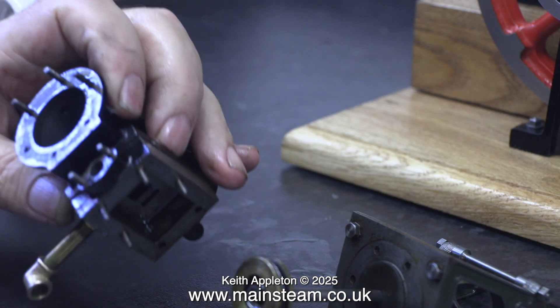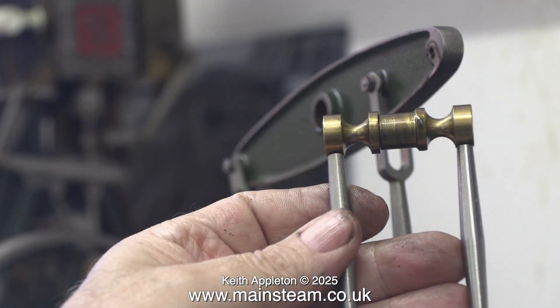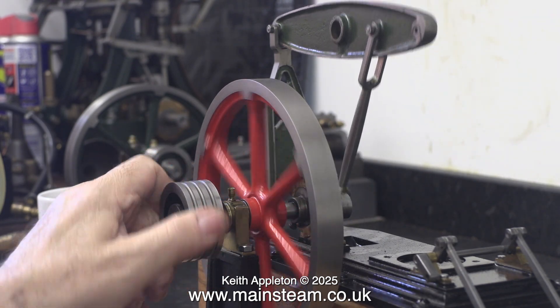Here I'm removing the old graphite yarn valve packing and I'm going to replace it with teflon-coated yarn, which seems to be better — or at least better than the modern graphite yarn. The old stuff was good, but I do think it contained asbestos, which was not good, and at least it didn't fall apart like the modern stuff does. This part is not a particularly good fit in the hole, and the hole is not in the centre of the beam, but you can't have everything. The engine does work quite well irrespective of this.